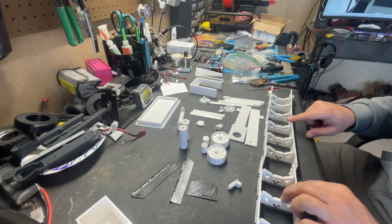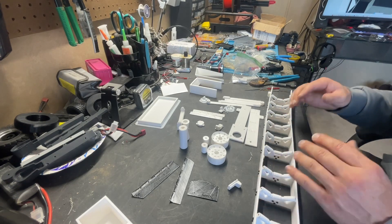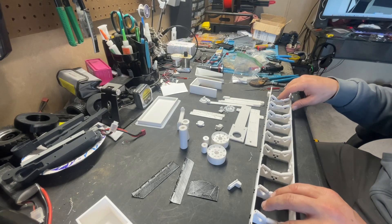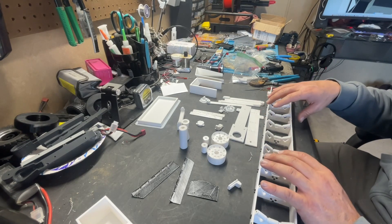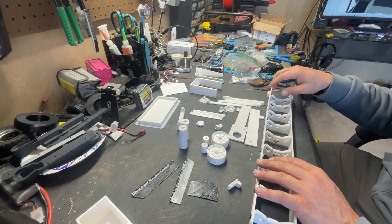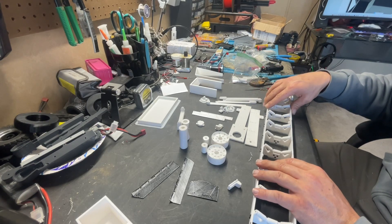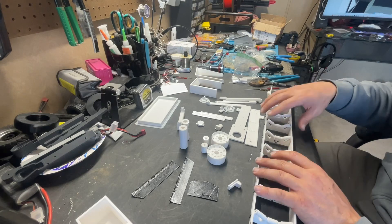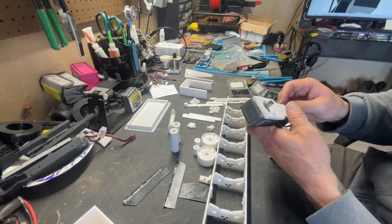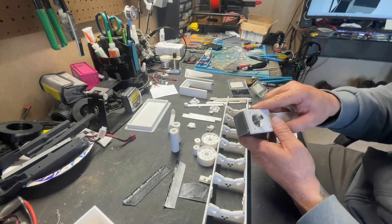I'm gonna go ahead and start putting all this together, and then go ahead and start getting everything else together — start putting the belt together and building that all out. I'm gonna do all this off camera and then come back to it. This is real tedious to get all the screws and stuff in. I'll probably build all these, get the hopper and stuff set up, and then start the video again — maybe do a time lapse. This should have been mentioned earlier: you're gonna probably want to mount your motor first. Your motor's gonna end up kind of go here, so I'm gonna go ahead and drill these out to 4 millimeter just to make sure it's nice and easy.